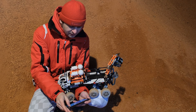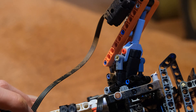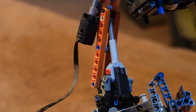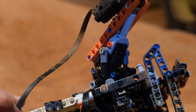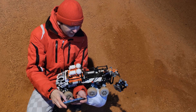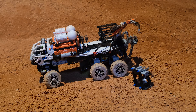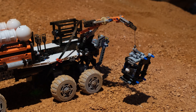There are two more motors which are much more visible here. This one is actuating the linear actuator for the arm. The model and motor are designed so that it can easily be inserted into the actuator. This motor is actuating the main arm up and down. And lastly, we have one more micro motor which is powering the winch, and the winch is basically lifting and lowering the load.